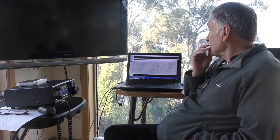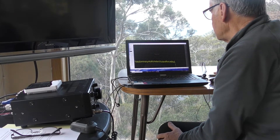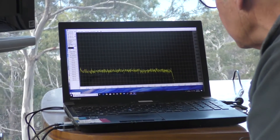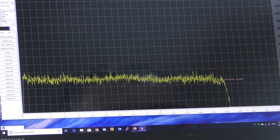Lovely and stable. Some of the things that are a benefit over the 910 are that the pass band is essentially flat from about 200 hertz out to almost 3 kilohertz. So for wide band digital modes like Q65 or even JT65, you want a nice wide flat pass band. Whereas my 910 has got ripple — up to about 2.5 dB of ripple. What we've done here is feed broadband noise into the radio and then look at the pass band. It's essentially a flat pass band all the way up to 3 kilohertz.